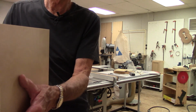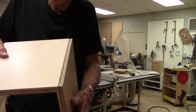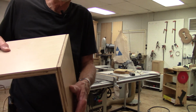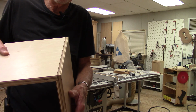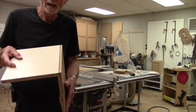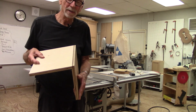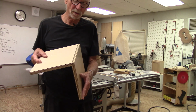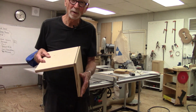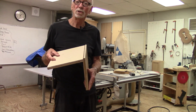Okay? Now, unfortunately, you're going to see that plywood somewhere, or maybe it's hidden. If you want a joint or need a joint where it's not appropriate to see plywood, and usually in my book it's not appropriate to see plywood in any kind of a decent joint, then you want to do some kind of a miter joint where you don't see any of the plywood. The edges are all shown, they're captured. And a 45-degree miter is a little tougher to do and certainly tougher to glue and nail. So I'm going to show you a 30-degree shoulder miter joint.